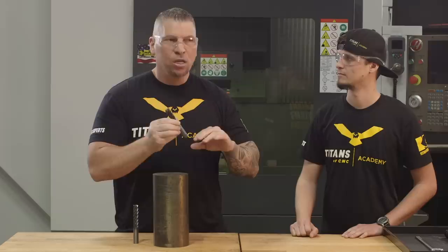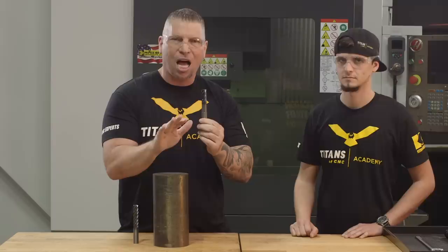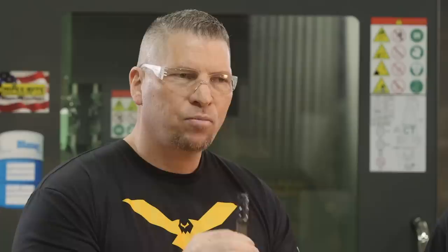Let me be very specific: all end mills are not created equal. You've got to make sure that if you step up to big jobs, you step up to the right tooling — truly talk to the applications people who actually designed that tool. Start with their speeds and feeds, understanding it'll probably be on the conservative side, and then push it. Keep the data: what is the chip load, what is the surface footage, how many minutes in cut, what type of cut. Keep that data and bank it, so when you quote your next job you know exactly how much it costs to rough that material.